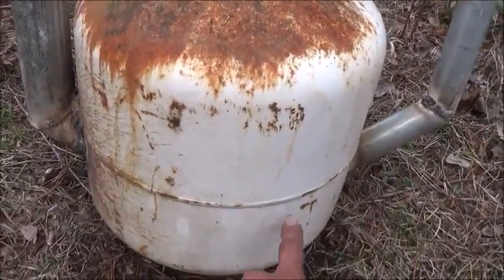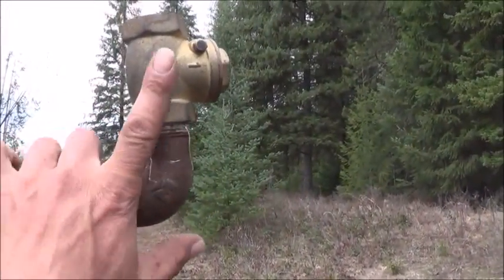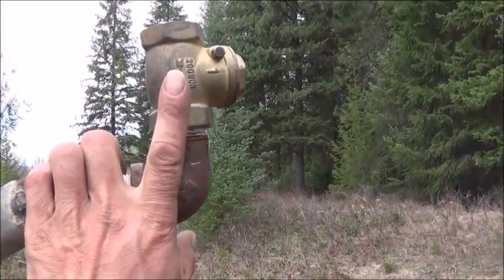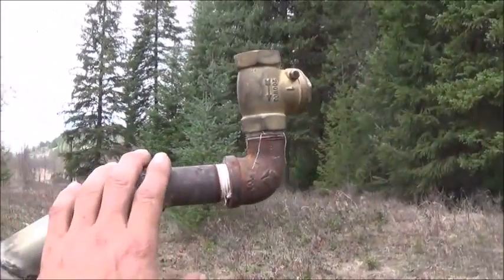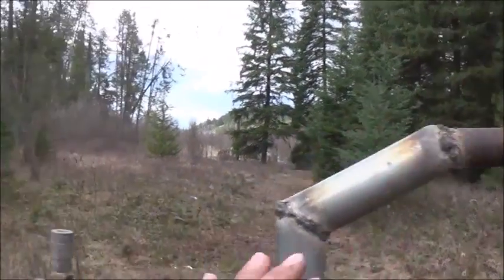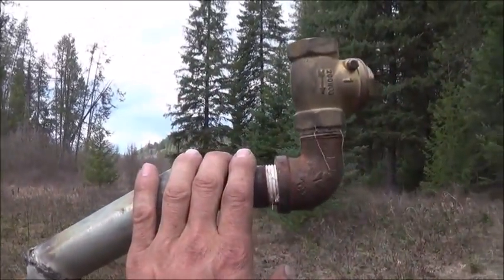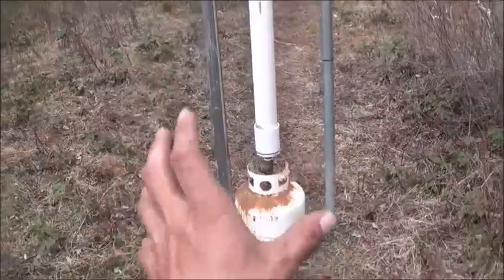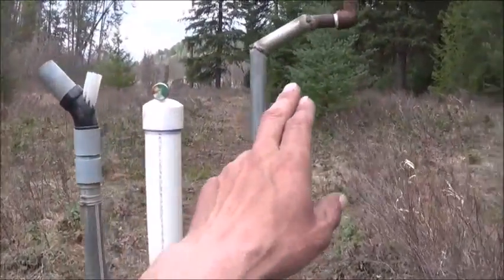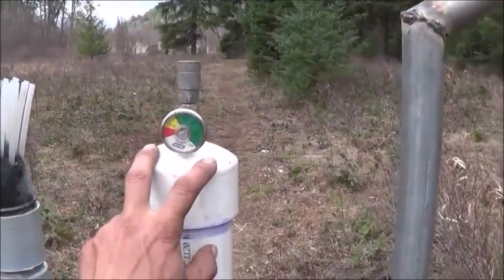As the speed of the water goes by and comes up the pipe, this one-way valve right here closes in this direction — so flow goes this direction, just like the water ram. To make a water ram work, this output is going to have to be at least three feet lower than the head input on the source side. We're going to end up burying this whole system in the ground, cover it with rust-inhibiting paint, so just the overflow and compressed air output will stick up above ground.